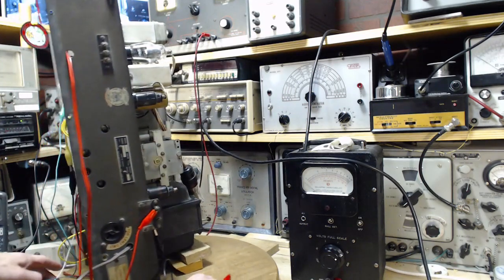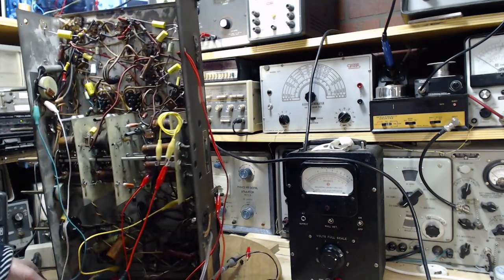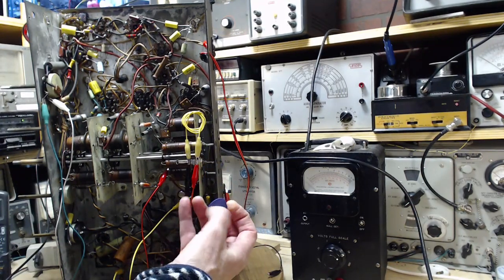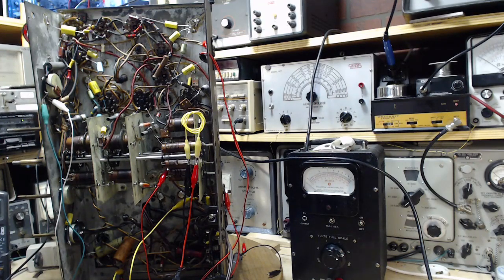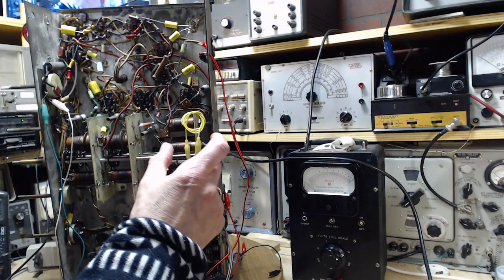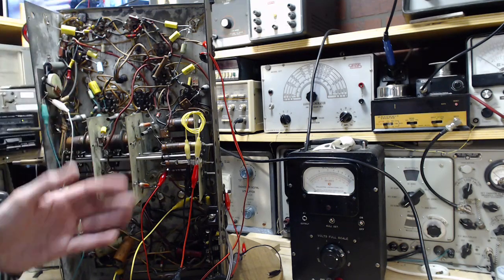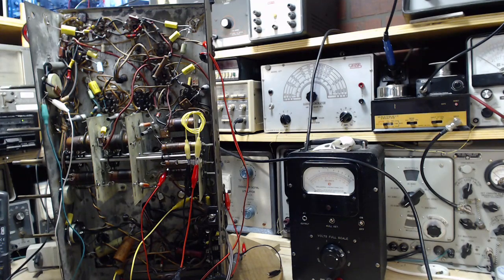And lastly, this is a late 1930s radio. The tubes are three-letter designation tubes. That indicates a vintage where, again, the radio is a little more precarious. As you could imagine, as time went by, and this would be true of virtually everything, the original designs were a little bit on a knife edge to get them to operate. Then, as time went by, they learned new circuits, newer tubes, and all this kind of stuff, and that knife edge gets wider and wider at the top. So the radios become generally more tolerant as you go along, so I believe. Anyway, this is an intolerant radio. And it's worse than that.